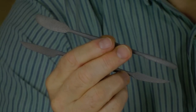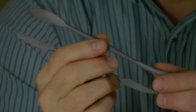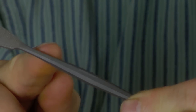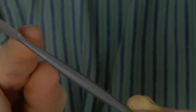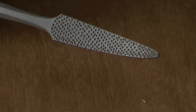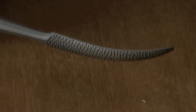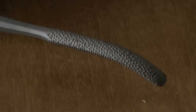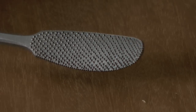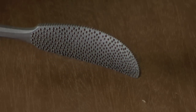They're about seven inches long, which is 175 millimetres. They've got a rather beautiful octagonal handle. The four ends I find most useful are: the knife end, which has a serration along the edge; what's called a half round, which is slightly curved and flat on one side; the thumb, which is more of a rounded flattened rat-tail shape, also bent and working curved on both sides; and this very new shape which is a wide laurel leaf.